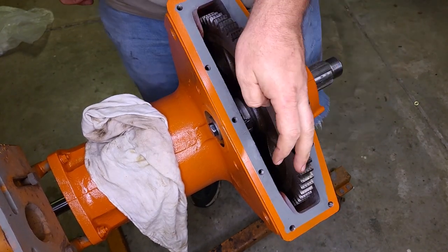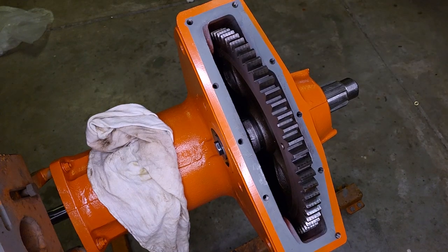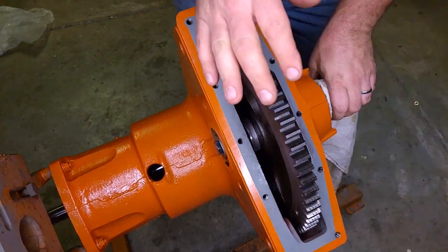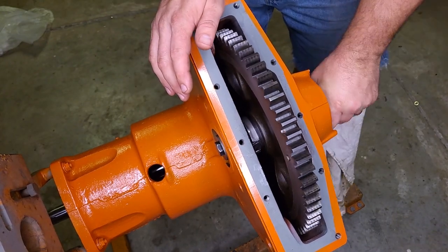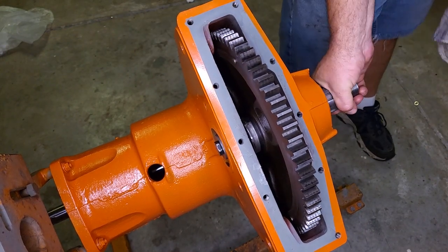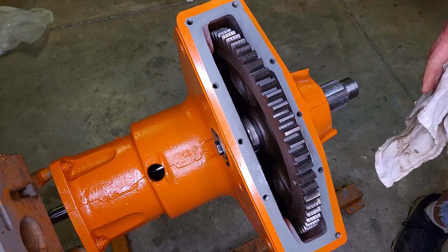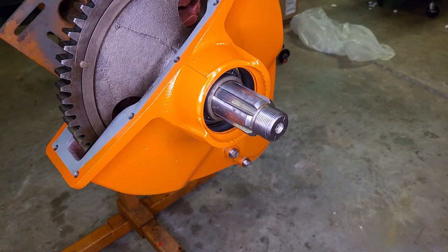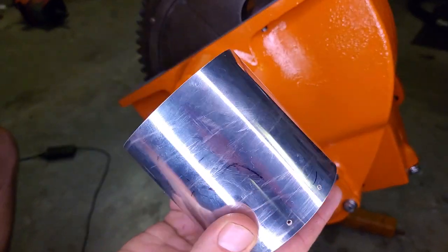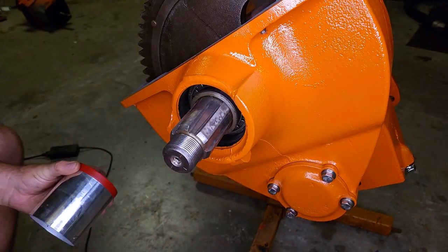This particular set of gears is off the parts tractor, and the bearings were replaced at some point. I don't think the tractor housing ever had anything done to it. Also there's no side load or anything on the nut. Next thing I'm going to do is install our axle seal. I don't have a seal installer that big, but I do have this metal tube. I'm going to tape the seal onto the end - the tape will hold it until it's seated, mostly.